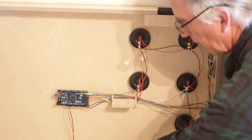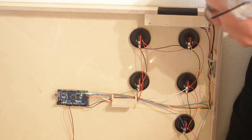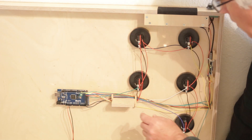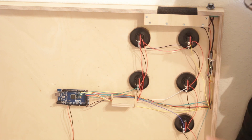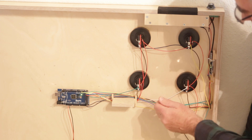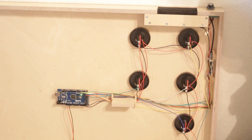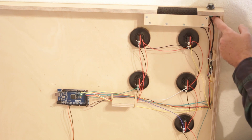The power wires for the Arduino come out here, and there's a larger wire with a plug on the outside where I plug in the AC adapter. The Arduino is mounted on wooden standoffs glued to the board, with plastic standoffs screwed onto those — I'll show more detail in my article linked below. Power and ground go to each button wire; I use the matching wire color — green for the green button, blue for blue, yellow for yellow, white for white. The power drives the LED, and the ground and input wire handle the button press signal. The MP3 player is over here, sound comes out from that to the amplifier, and then to the speakers.